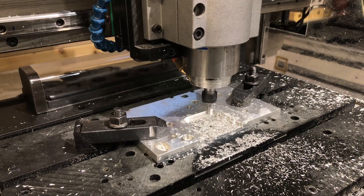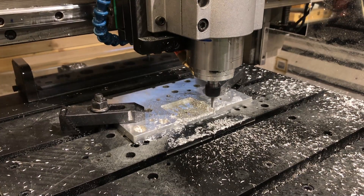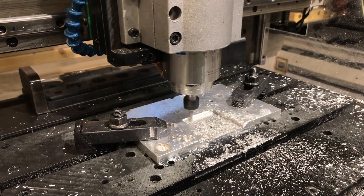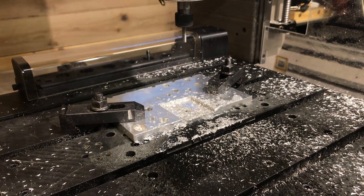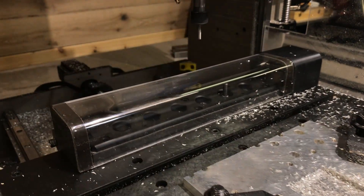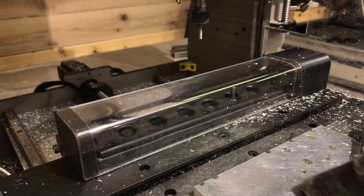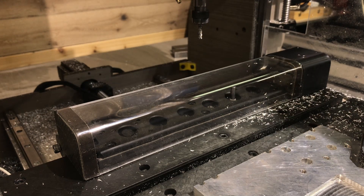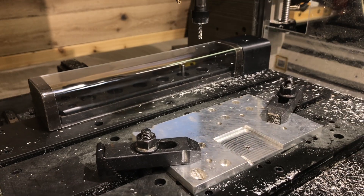All the magic happens below the retaining cap. In the end I've come up with a system that has been running extremely reliably — in fact I haven't had it fail once. I do have a sensor system internally that tells the machine whether it's dropped the tool off or not. It tries to drop it off again and then pauses the program with an M0 command if it fails, so the user can get the tool off and proceed. But I haven't had it fail.